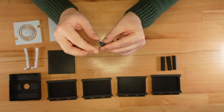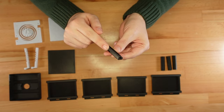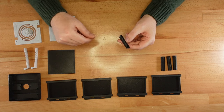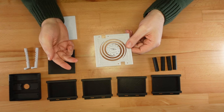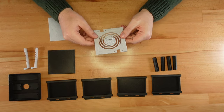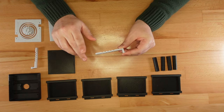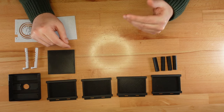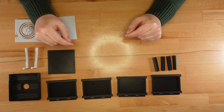First, the base clips will need to flex — I've had good results printing them in two perimeters with zero percent infill. You can even drop the top and bottom layers, since the ends of the clip will be hidden during assembly. When printing the spring, increase your perimeter count until the spring arms are completely solid; three perimeters will probably work. Add brims to keep parts from curling off your print bed, as these parts must remain flat to work correctly. Finally, I'd avoid using silk or matte filaments on the mechanical parts — these tend to be more brittle than regular filaments.